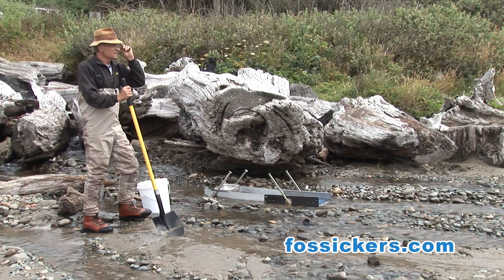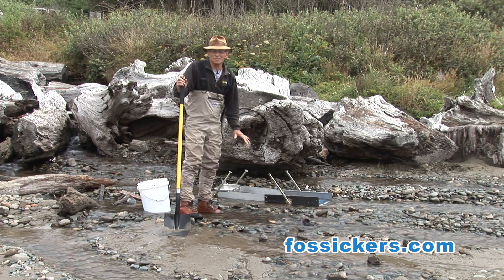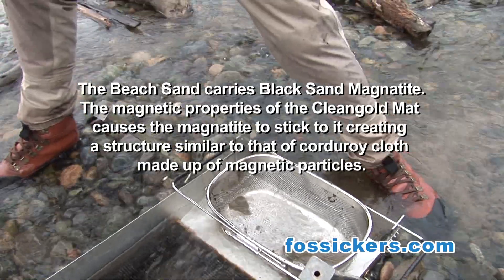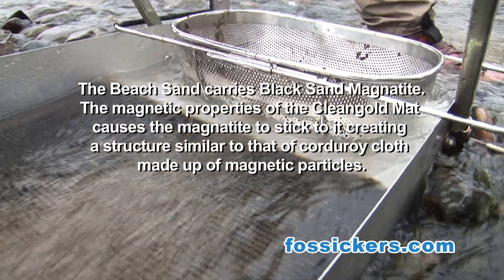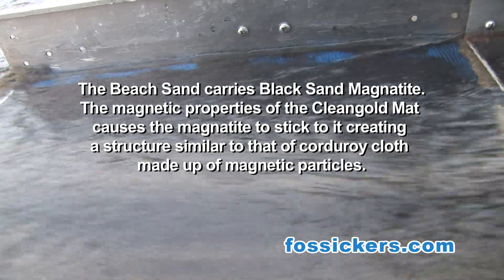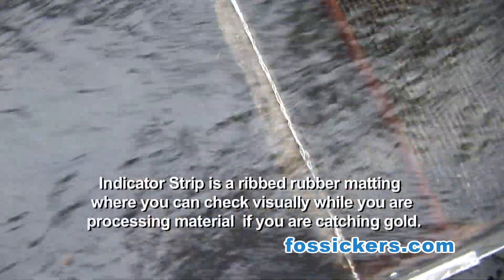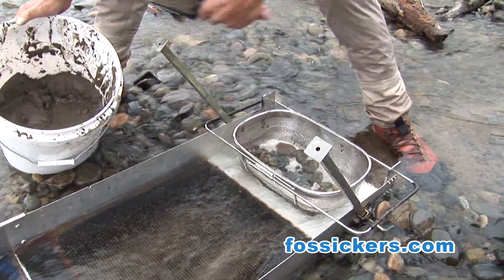The next step we've got to do — because this is a magnetic system — is charge up the clean gold part with some magnetite so that we can catch gold if we're lucky enough to get it here. The clean gold system is made from a magnetic matting that has multiple fine magnetic lines running north and south through it. When magnetic material like magnetite is placed upon this matting, it creates a structure made from magnetic particles that, when viewed, looks much like corduroy cloth. It isn't solid since it is made up of thousands of magnetic particles. Because this structure is porous, when heavy particles such as gold or platinum drop onto the matting of magnetite, it works through the spaces between the particles and conceals itself on the floor of the matting. This is a plus since your values are now well protected underneath a sheath of magnetite. One of the best parts of this magnetic system is that once the matting collects the magnetite it needs to run, it rejects all other magnetic materials, which makes it completely possible to run any type of magnetic materials forever without any collective clogging. This is the only system that can do this.